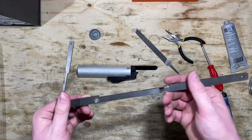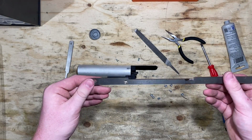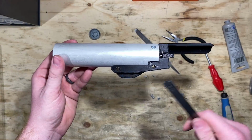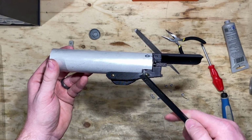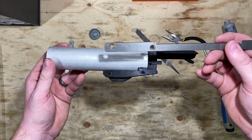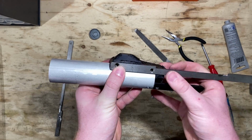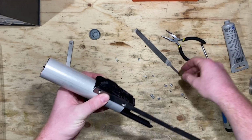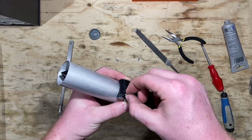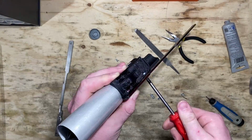Sweet. Now we're gonna connect the push rods, the priming bars, we could call them. You'll notice that if the tube is level, one hole is lower than the other, and same with these, one hole is lower than the other. And they're also countersunk, so that explains which side goes where. So this one goes on this side, and what you do is you just throw your nuts into these holes, and then a screw on either side.